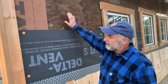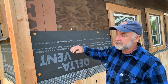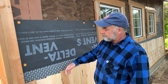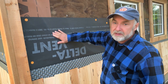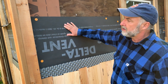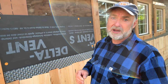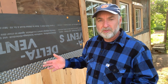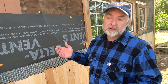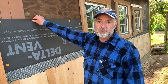This is the wood of the shed. This is three-quarter inch pressure treated plywood that I put over the old siding just to strengthen it and give me a solid base to anchor these shingles. Now we've got a breathable membrane here. This is different than building wrap — I don't really like building wrap. It's flimsy and weak. It deteriorates because of the glue that's used in wafer board, and it also can trap moisture behind it. This is different. This is a lot stronger.